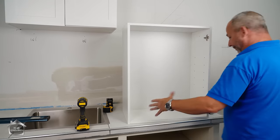And then just work the mud to the corners. And if you don't have enough, you can add it behind and simply close it up. Okay. That is what we call a California patch. And the reason we like this is because the drywall paper that's on the drywall face is thinner than the paper that comes on the rolls. So generally it takes one coat of finish time out of your job. Once you've done that, you can just add that thin coat all the way around.